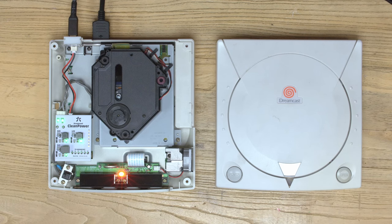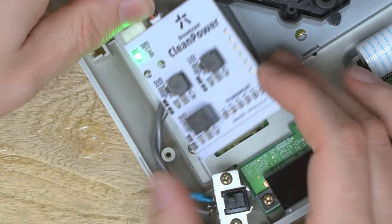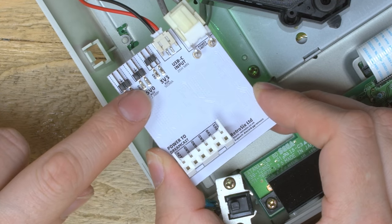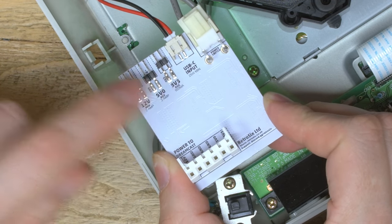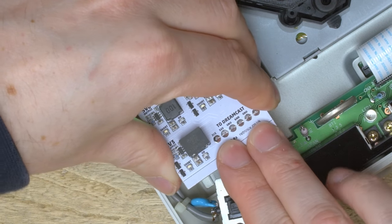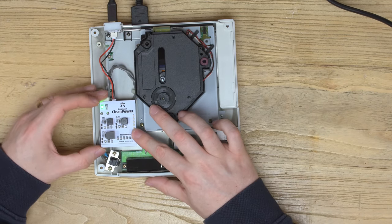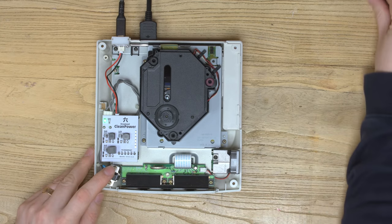Inside we now have tons of free space in this area that we could possibly do some other kind of mods with. If you've got anything you think we might want to invent or design, just let us know. We've also included on the underside of the Clean Power board a couple of auxiliary power outputs. So if you want to output anything on the 12V, 5V, or 3.3V rails, bear in mind the limited current — the 3.3V you can only really tap half an amp off, but the 5V and 12V have quite a lot of spare power left. These could power new system fans, LED kits, or future mods. If you significantly increase the power draw on the 12V and 5V rails, just make sure your USB-C power device can handle more wattage — go up to like a 45W power supply, for example.